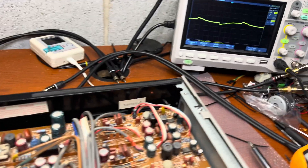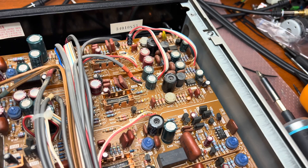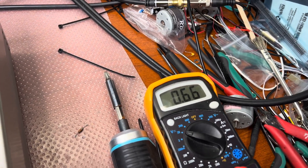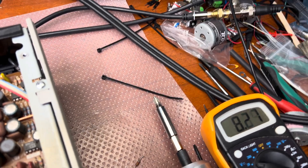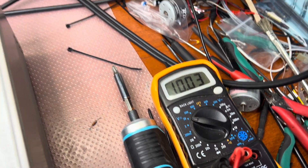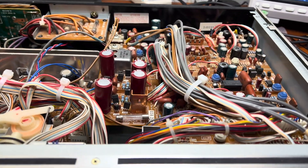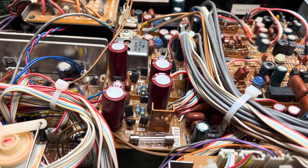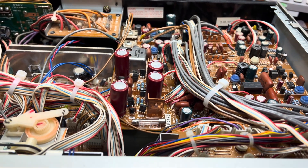What I observe is that we lost the negative voltage. Here at resistor 118 we have 0.6 volts versus the expected minus 9, and here we have positive 10 volts. So the positive voltage is there but the negative voltage is just dead. Let me check the capacitors and everything on this negative side.